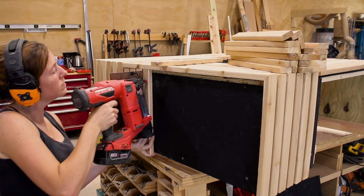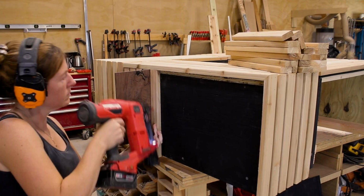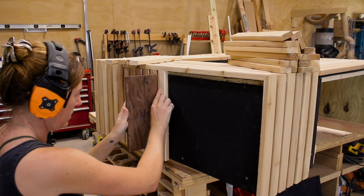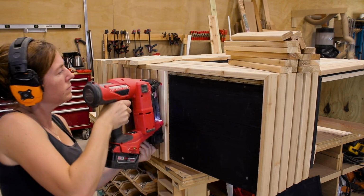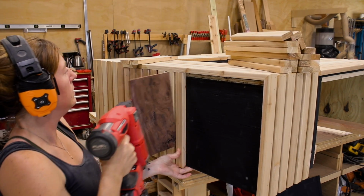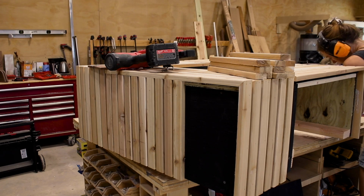These are butted up right to the underside of that overhanging top slat. And I make sure to use the same spacer so things remain consistent. One thing to note, all of these slats hang past the body slightly because I personally wanted casters on mine so that I can make this thing mobile when not in use. The overhanging amount will cover the added height.